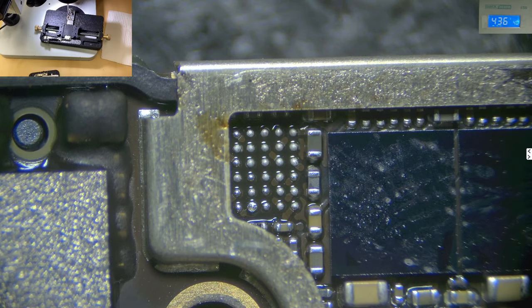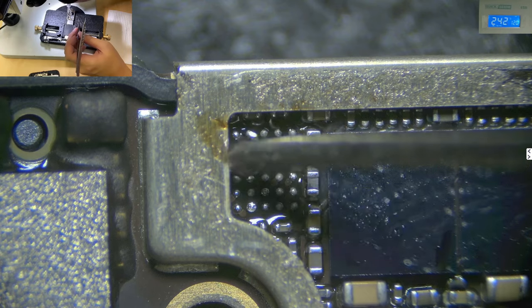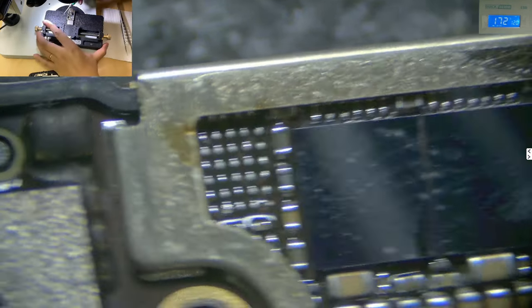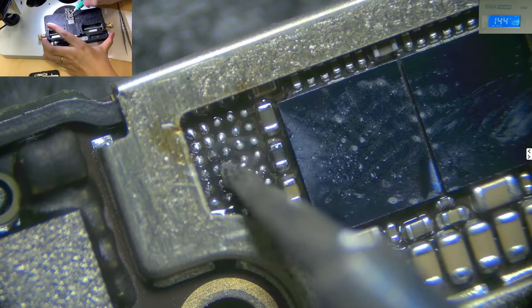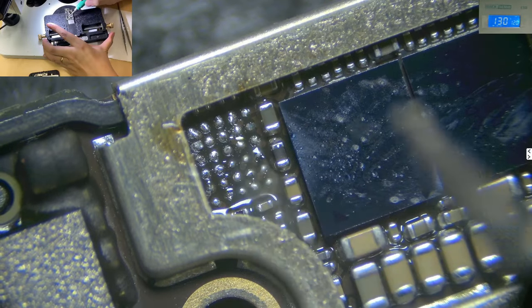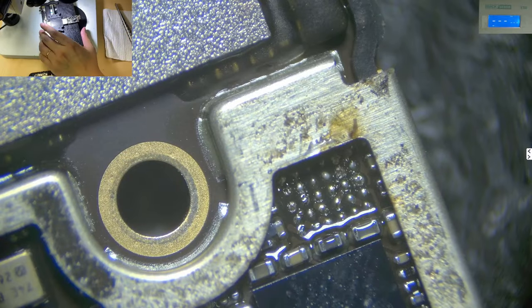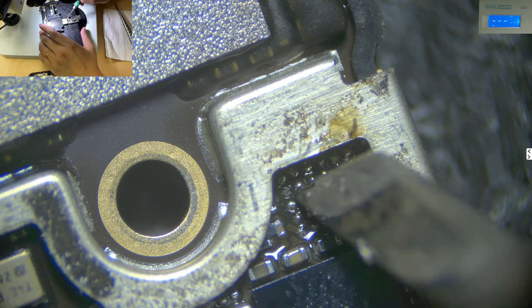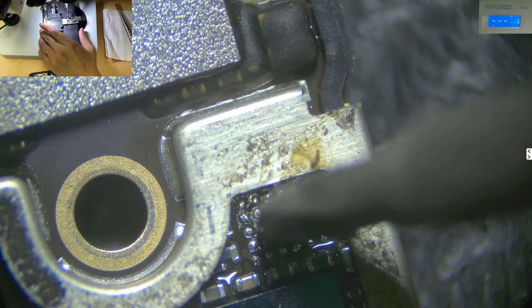Okay, that's it. While the board is hot, put some flux and try to clean off the solder balls. This is the time you should use a proper size soldering tip — a small size will be enough, and it needs to be hot enough. You don't need to use solder wick at all. Even a bigger size solder tip can still do the job — it can still enter to take off the balls. You just touch them and they will suck up onto the solder tip. You don't need to remove all the balls, just on average it will be enough. Then you replace it.